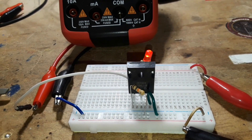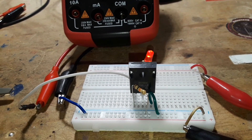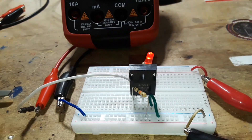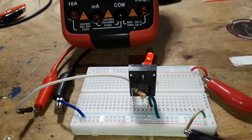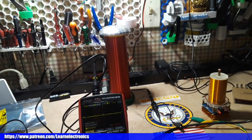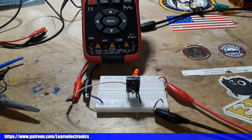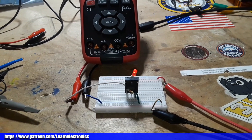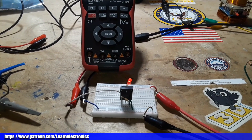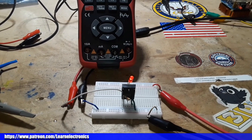It's absolutely cold at an input of 12 volts, but we're going to put in quite a bit more — 120 volts RMS, so 120 times 1.414 is like 173 volts. That's what we're going to be driving the big coil with. Stick around for that — we should have something up and going in a week or so. Hope you enjoyed this video; give me a thumbs up, comment, share, subscribe, and check out our sponsor Solder Stick.